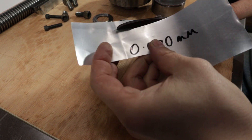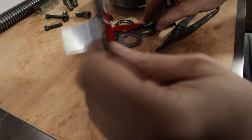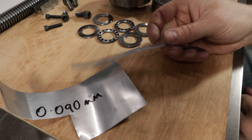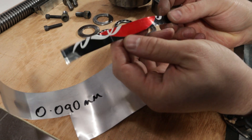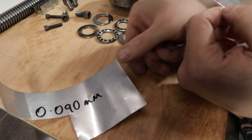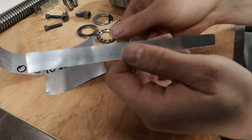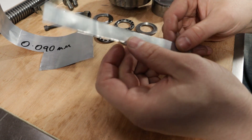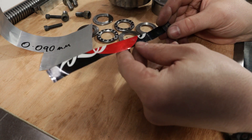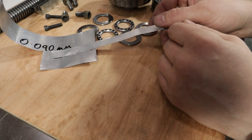I've got another tip for cheapskates like me — have a look around you for things you can use as other things. I use shim stock and I've got a pile of brass and stainless shim stock, but why would I use that if I can use some old Coke can that I've rinsed out and flattened out? This stuff is pretty consistent in thickness. For this kind of application I'm just going to wrap it around something in the chuck — I don't need to use anything fancy, I just want to protect the workpiece. It takes no effort to cut these up and you can flatten them out and they take no space to store.